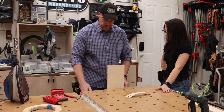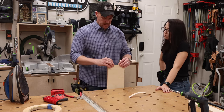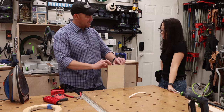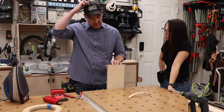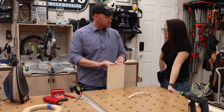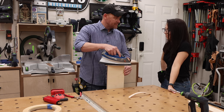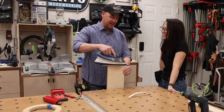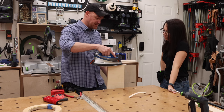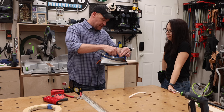We're starting with the sides first since I'll always be looking at this from the top down as a drawer front. Make sure the banding is roughly centered with an overhang on both sides — about a sixteenth of an inch or so. Use the iron, going back and forth or holding it in place, and the glue starts to melt. Make sure we're nice and hot — no steam. Once you hold it in place and it starts to stick, you'll see the glue is a little wet. Just let that seep in a little bit.